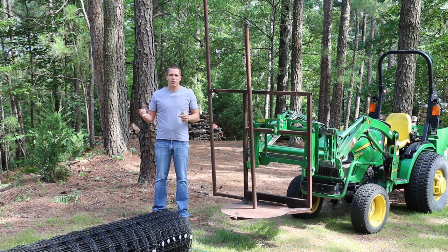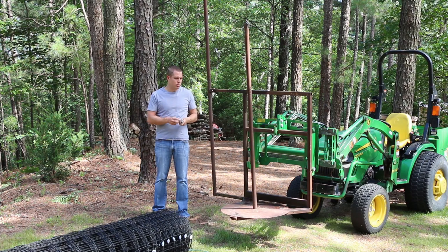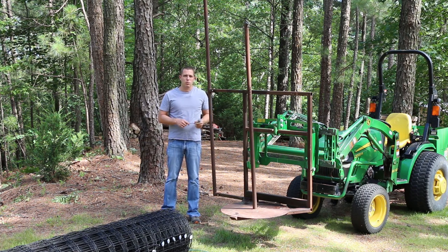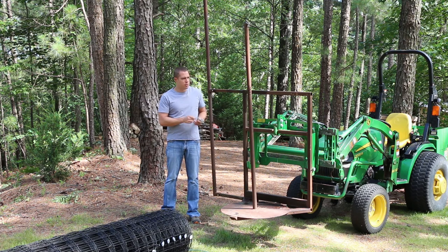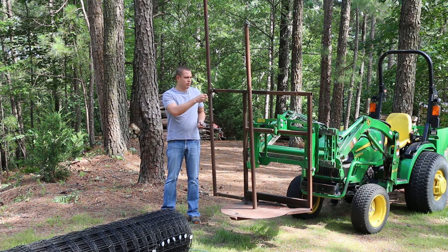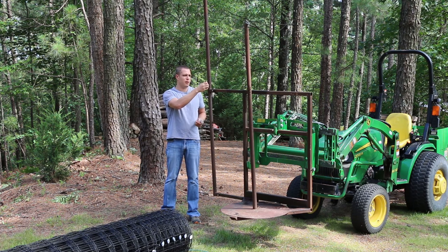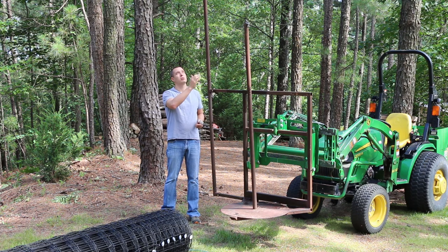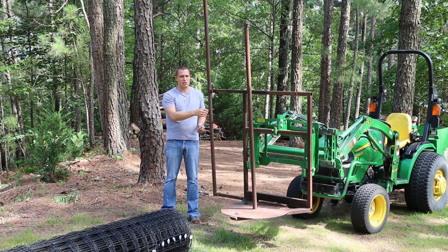I've got a quick system that I use to attach the wire to metal posts that I'll show here in a little bit. But once we get past the post that we're going to tension, we take these pins, and I've got holes drilled in here. So then the wire gets caught on this. So we're able to tension all the way up and down this using these pins.